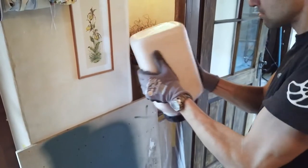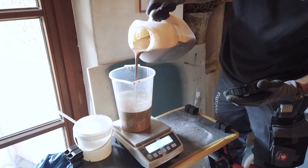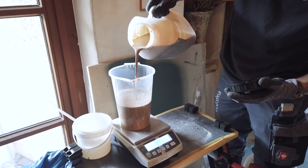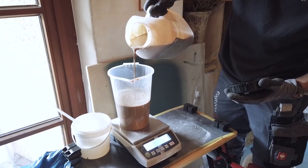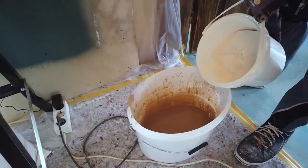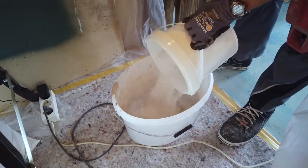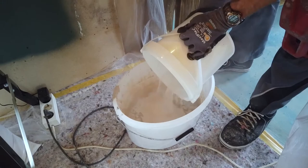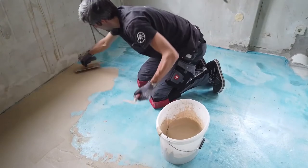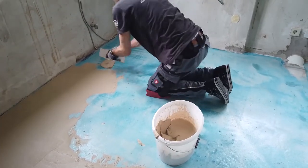Close the canister and shake the contents well. The liquid must then be transferred to another vessel up to an exact quantity of 1,150 ml, then placed in another larger processing bucket. The microcement powder is filled into this bucket. The mixing ratio per bucket must always be observed — mix powder and pigment resin liquid well. The quantity is sufficient for about 5 square meters of floor space.